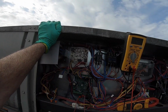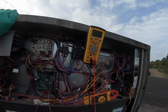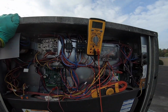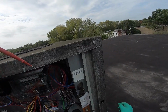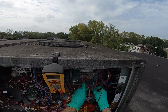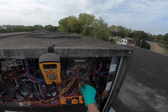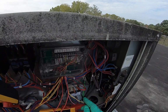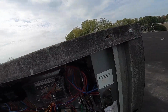Okay, so. Success, success, success. I bet you it's got something to do with the 20 volts I have going through the circuit, because that's too low. Let's kill it and see. Before I touch, okay. Just see what happens here. Remember, you have to move the wire that's here, not this, or you create a short. Even look, it moves a little. Well, let's see what happens.